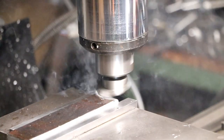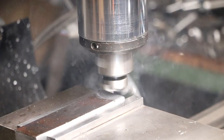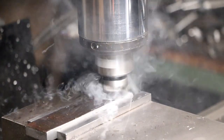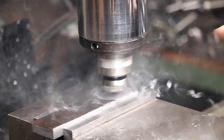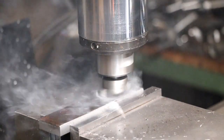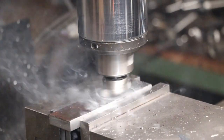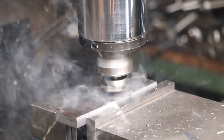You may have also noticed the swivel part of my vice has disappeared. It's because when I did those big plates, I measured them and I've got about 8–10 thousandths of a millimeter difference at each end and I couldn't understand why. You remember I ground the top of this vice — so I took the swivel base off, put some parallels in and went across it with the dial indicator and I could see I was out, something wasn't quite right. So I took the swivel base off, just bolted the vice down itself, did the same test again with the parallels in the jaws, ran the dial indicator across — absolutely smack on. So obviously that swivel base needs some attention on the grinder.